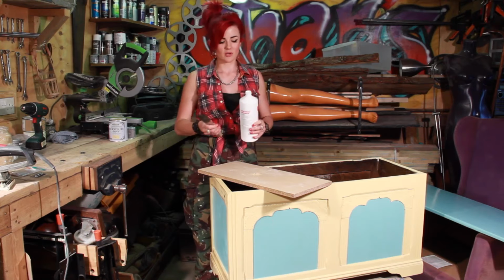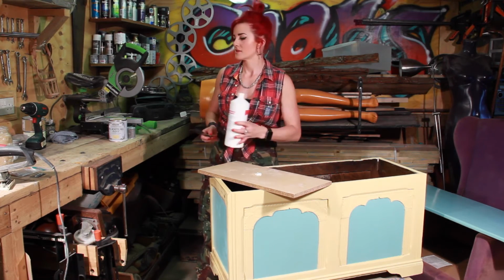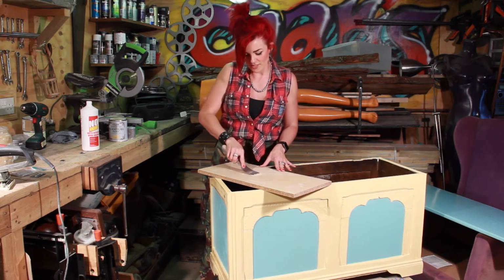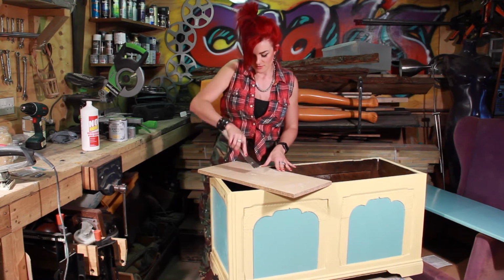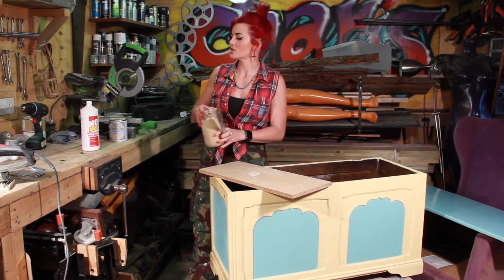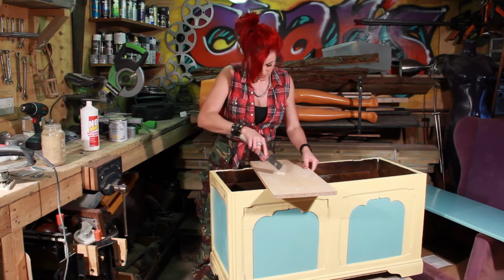And then you need some wood glue, and it's as easy as tipping out a bit of glue and mixing it together until you get the right consistency. It's actually harder doing small amounts of it, I think. Now this stuff sets really rock hard. It will be stronger than the wood was previously. So what you can do, if you think you haven't quite got enough sawdust in there, or your consistency is not right, just add a little bit more on top. Mix again. Now this is going to go off really quick, so you want to get it in the hole as soon as you can.